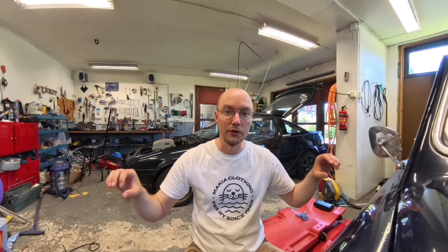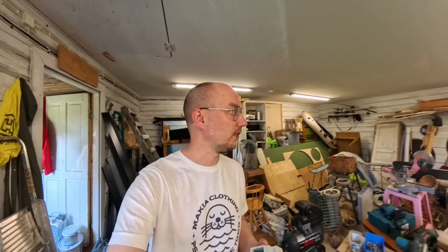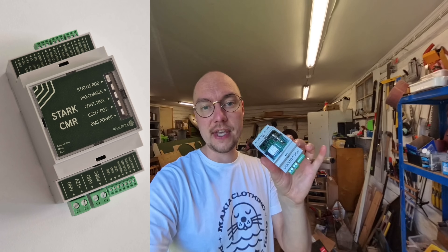What I set out to do here with EVNX is I've created a high-voltage connection. I've set up a DC link wired inside this house that goes all the way out to the wall, so I can plug these two together via some switches. I've also made some CAN cabling run on the wall so that the battery emulator can intercept this other battery. To get the two CAN channels you basically have two options. The best option is to get the Stark CMR board, which is set to release in a few weeks.